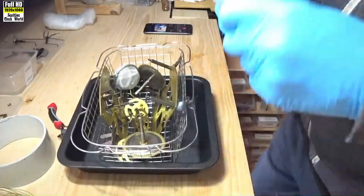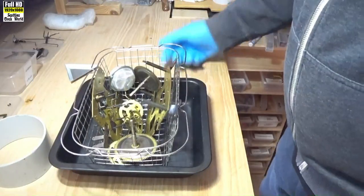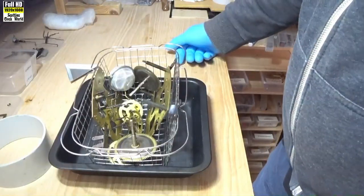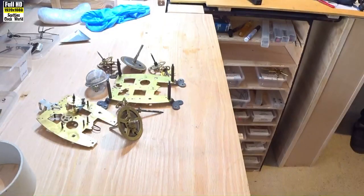Right, so there's all our parts. As soon as the cleaner comes up to temperature I'll put them in. We'll clean them for five minutes — no more than that, we don't want any pitting on the brass. Then we'll take them out and come back to the bench and see how clean they are. All the parts are back from the ultrasonic cleaner now and they're all looking pretty good. In the next video we'll check the pivots and the bushes, see if anything needs rebushing, and do a general check to make sure everything is working correctly before we assemble the movement.